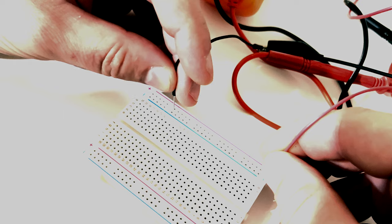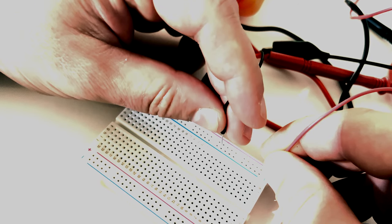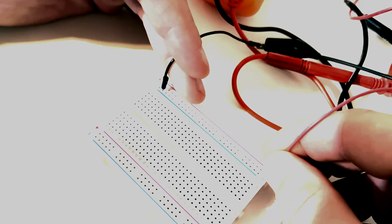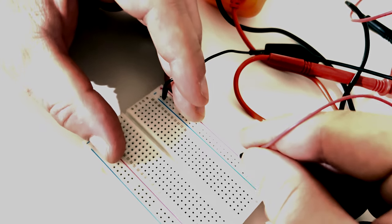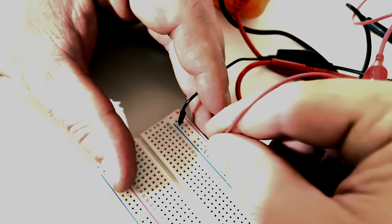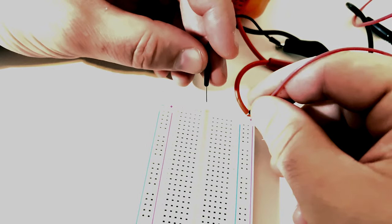So breadboards have bus strips that connect several rows together, which means that they share a current path and have continuity. Continuity simply means that electrical components are connected together. That's it. The first thing that anyone using a breadboard needs to do is to identify or find the bus strips and identify their paths so that you will know how to connect your circuits.